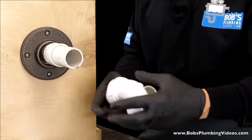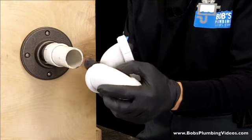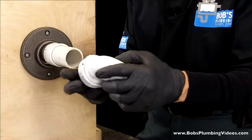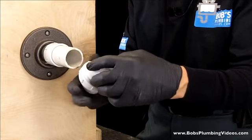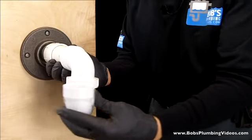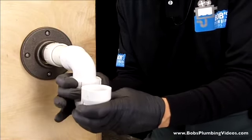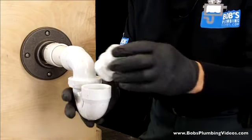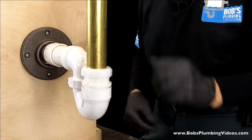They also make traps with a big nut on them, which gives you adjustability without the one-shot commitment of gluing — you can loosen them and swing side to side. I put a lot of pipe joint compound and Teflon Mega Lock on there. To transition from that trap up to the sink, you simply use a trap adapter and that gets you to the tubular stuff.